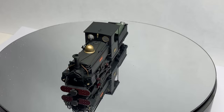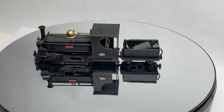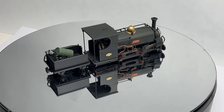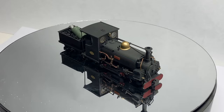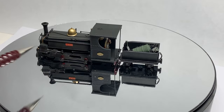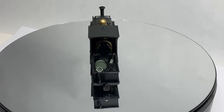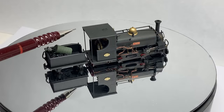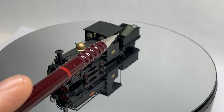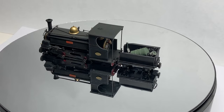I basically lopped off the top there, drilled a small 0.4mm hole very carefully — sounds really tricky but it really isn't. Using a drill in a pin vice, which is controlled by your hands with no motor, you just very carefully open that hole up and then feed in a piece of replacement wire. I probably started with the 0.4mm drill and then opened it up a little more to make it easier to get the wire in. On the front, we've got a vac pipe — she's now vac fitted — which means there's now an exhaustor, a pipe here and the vac pipe underneath the tank, so those needed adding and they're just brass rod. Then obviously the cab back's been removed. I carefully cut it off and pared away with the blade to get the correct shape at the top, and I've drilled a hole to fit my own handrails. The bottom just popped off nice and easily.